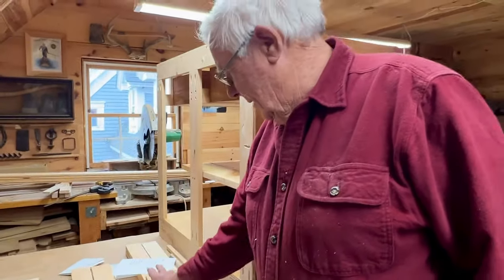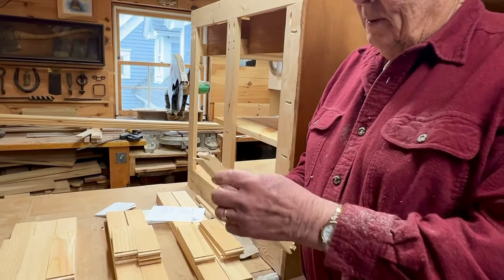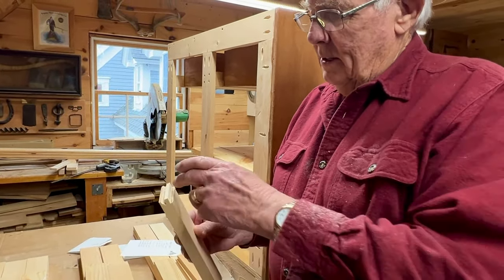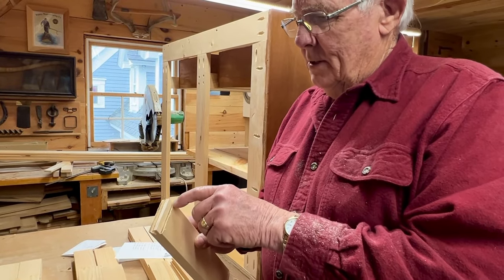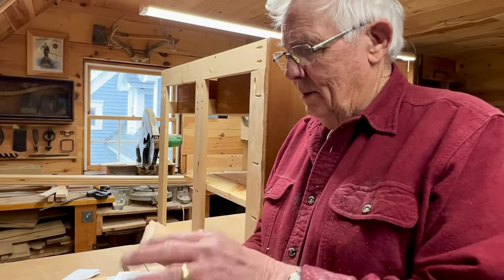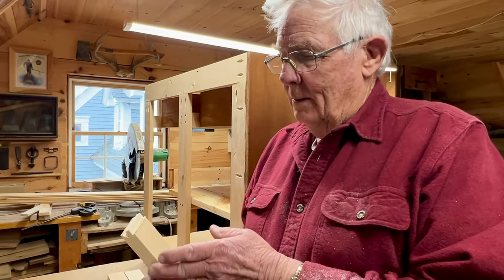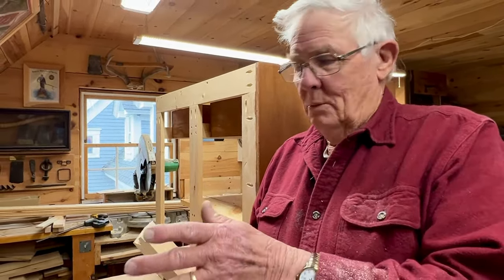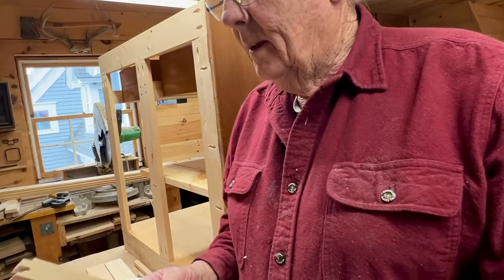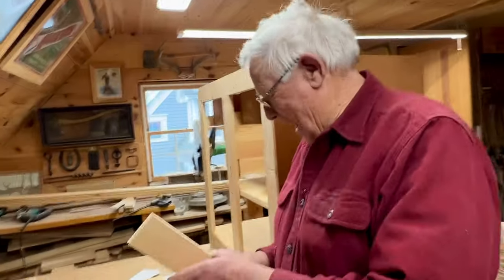And I like to do this particular cut first, a cross grain cut, because the other ones, sometimes if you did this one first and this one second, this chips out when doing the cross grain. You get a little chip out of it, so doing it this way, if you do take a chip out of it, usually the other cutter, the way it's shaped, will take out the chip, so you don't see any. And I notice you like to have the V cut on the same side on both ends and the square cut on the same side on both ends. Yeah, right.